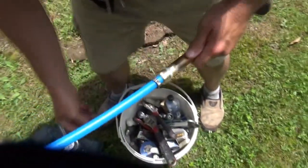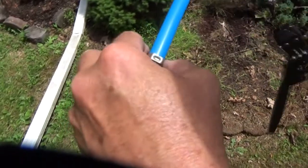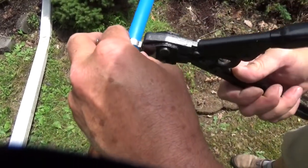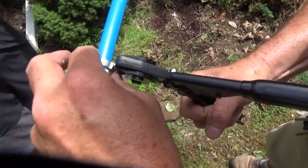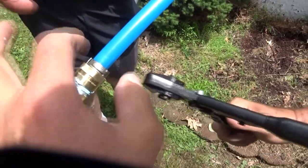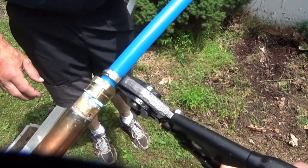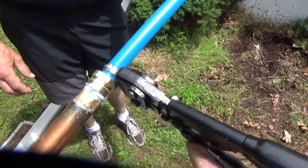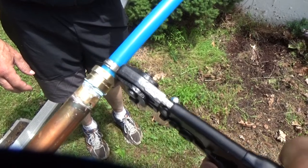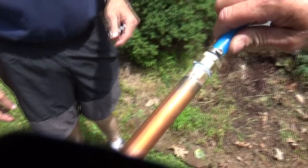Put it on. Beautiful. Cinch ring. I don't like these particular ones. Then you try to keep it an eighth to a quarter inch off this face — that's what they recommend. These particular cinch clamps, I don't care for. They're a little loose. The ones from Cash Acme fit on the pipe a little snugger and they're easier to work with.